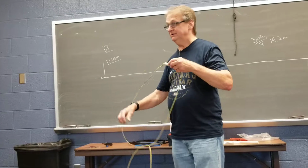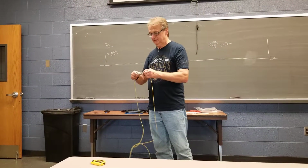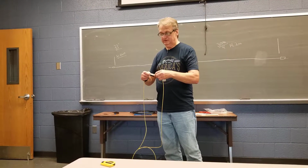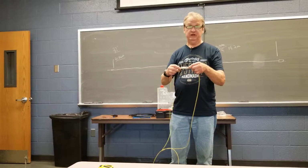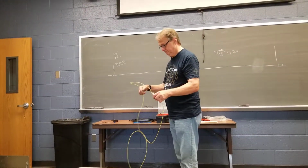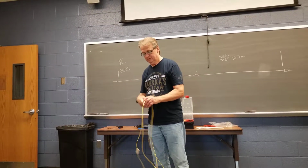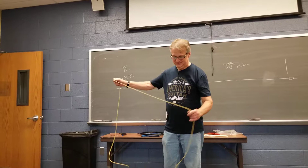Does that help with tuning? Yeah, it'll help it a lot. You think it's funny to say that, but there are people who have bundled them all together and soldered them all to one spot and wondered why the antenna was a dead short.